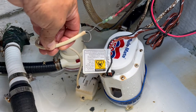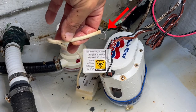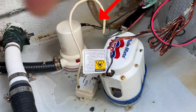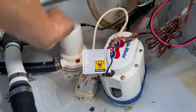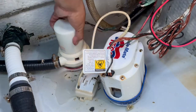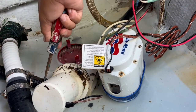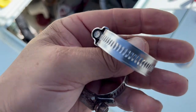As I start to undo all the wires and separate them, I find the cause of the problem. As you can see here, the bilge pump wires are a little too short, so I'm going to lengthen them, which is going to require me to pull the bilge pump out and add a couple of pieces of wire to make it a little easier to reinstall. I'm also going to remove the hose clamp and probably install a new one, as this clamp has a little corrosion on it — I'm going to upgrade it to a better quality clamp.